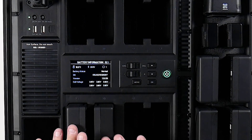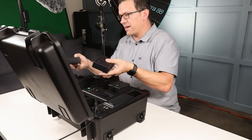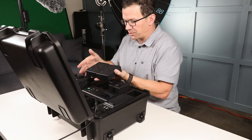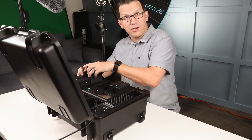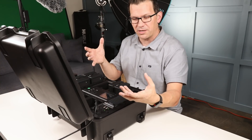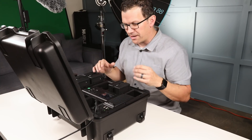I can scroll through my various batteries with the up and down arrows. Quick tip: when you buy your batteries, DJI gives you little stickers — make sure you're marking them so you can keep them in pairs and use them at the same rate. You don't want to be using a battery that's been used 35 times paired with one that's been used once. Keeping them paired together also helps you keep the firmware consistent between them.